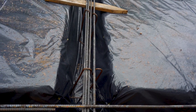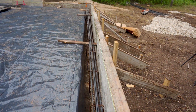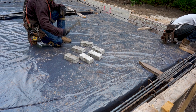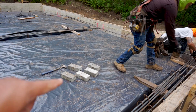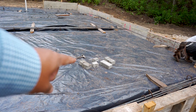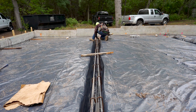You can see what's going on here. They have all the rebar suspended by wood stakes, hooked only on two bars. They're going to go all the way around and tie all those stirrups to those top bars. We use bricks to hold up the rebar. You can use chairs — they sell what's called a plastic chair or rebar chair. I prefer brick, but it has to be a solid brick. Engineers will not approve the use of a conventional regular brick, so it has to be what they call utility brick. After you get the stirrups hooked, he just drops the two bars in the middle into the beam.